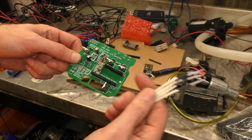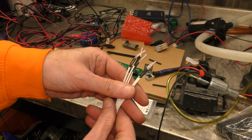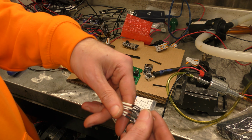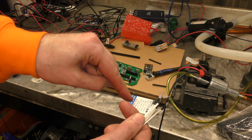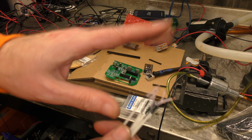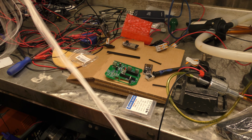and that gives us our temperature sensors that, well, we can either Kapton tape onto the side of the heater or stuff up the exhaust or put them into the silencer hole. That's always sometimes a good place. The Chinese and the Webasto silencers have got like a drainage hole to let the moisture out. You can poke one of them up inside and it gives you a fairly goodish temperature. Again, you can tweak it in the software if need be.